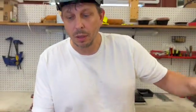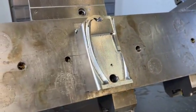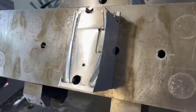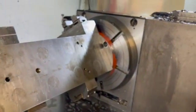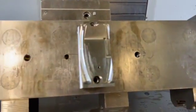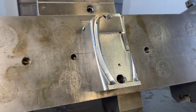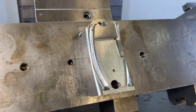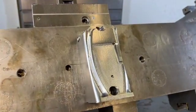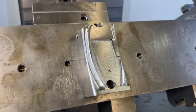You want to show me the fixture? Sure, we'll walk over. So we're inside the CNC machine right now. This is a Haas machine with a fourth axis rotary. There's a big trunnion that comes out from it. It works well in that we're able to use four axes on a lot of parts at once. It's a pretty good sized machine — a VF4. You can kind of see how this rotates, as well as the spindle goes up and down. The table moves left and right in the back. So four axes total.